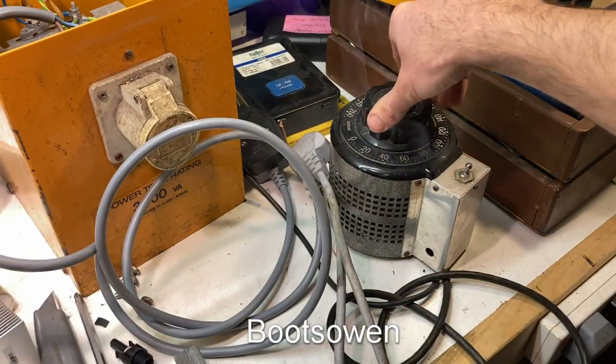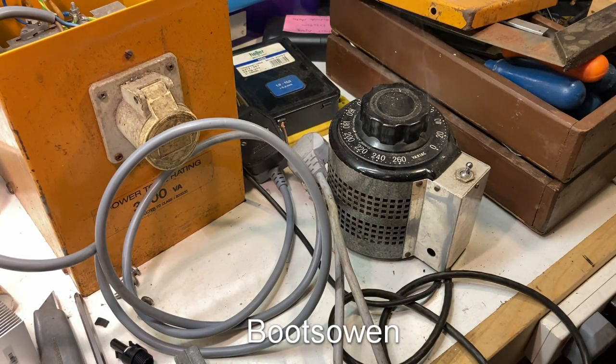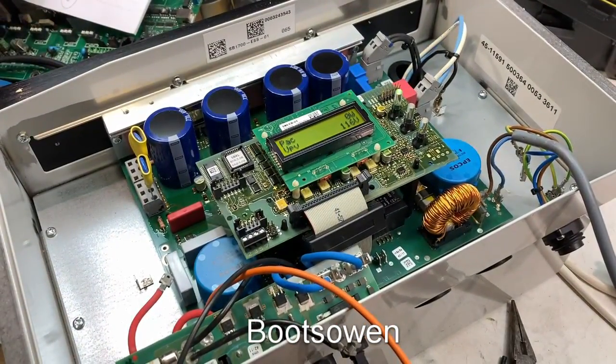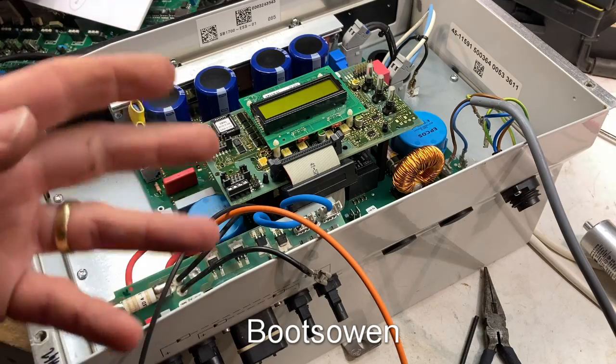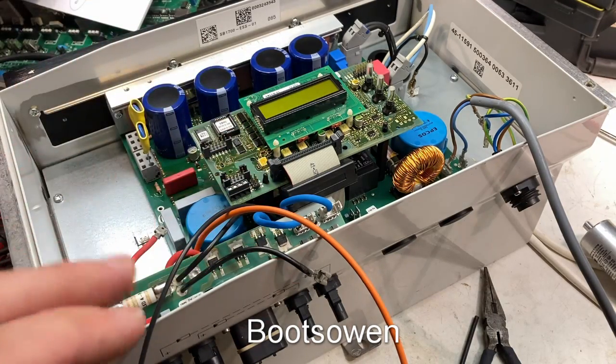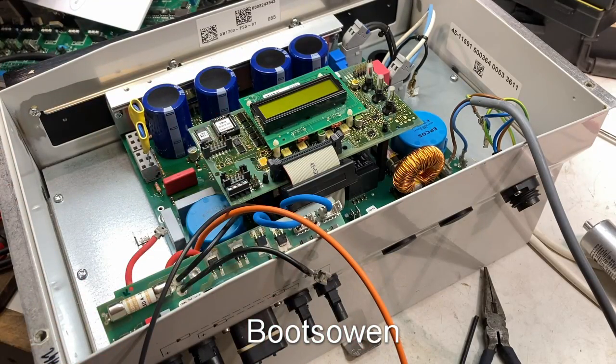I think I'm running that variac a little bit hot, because it's putting out smoke. The machine's clicked down because it's lost its DC — down to zero watts and the voltage should follow immediately. The variac shouldn't put out smoke. I suspect it's not necessarily melty smoke — I suspect it's dust smoke. That variac might not have been used in 20 or 30 years. I have a bigger variac, but three amps or whatever that one's rated at is certainly not enough. I'll have to start using the bigger one for the test bench.